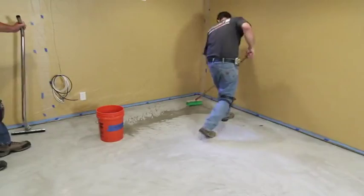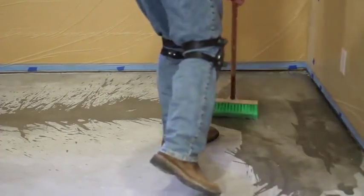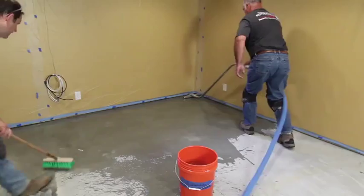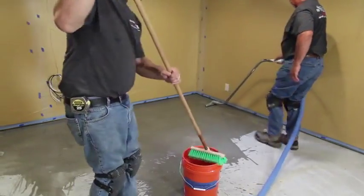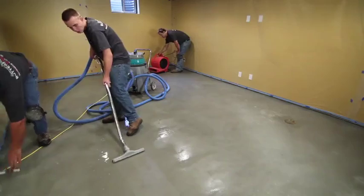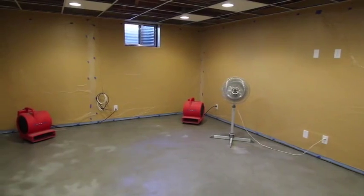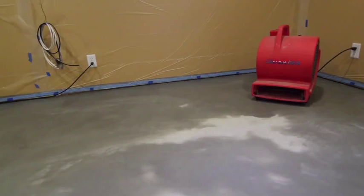Once surface preparation is complete, the entire area should be cleaned using hot water. Remove all residue from the surface using a wet-dry vacuum. If residue or contaminants from the cleaning process are not removed, they will prevent the T1000 Stampable Overlay from bonding to the surface. The area must be completely dry before proceeding to the priming process.